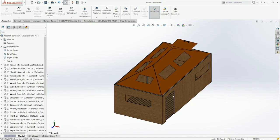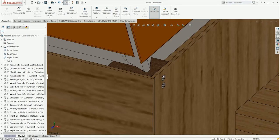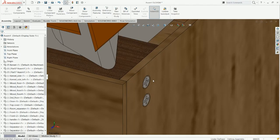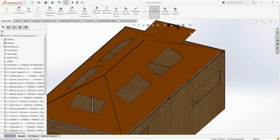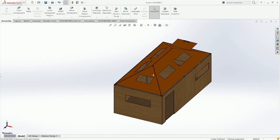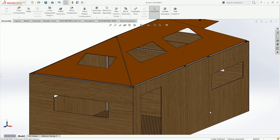Just as a side note, if you're a perfectionist, like I said, you may want to do all the holes in the whole assembly, just like I did now, and fill them with your smart fasteners. You can change other screws, and you can actually see if it's gonna work. If you select a screw that is too big, it may have interference between these two, so that's something you have to take into account. You have to adjust these hole separations for the hinges that you're gonna need, and other than that, it's gonna be pretty much done. So you can Loctite the acrylic on the sides, so your dog can have some lighting, not some light. And other than that, it's all good.